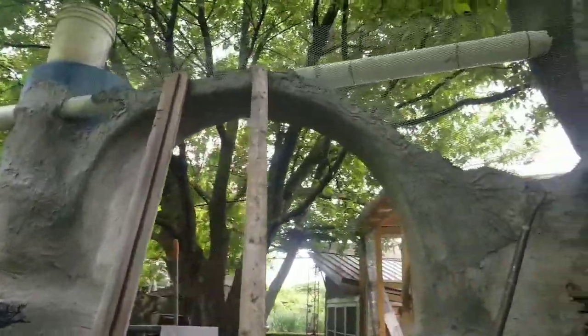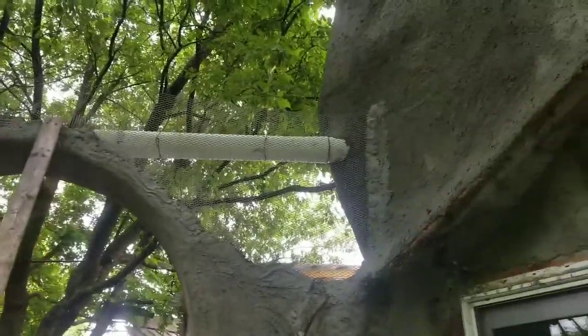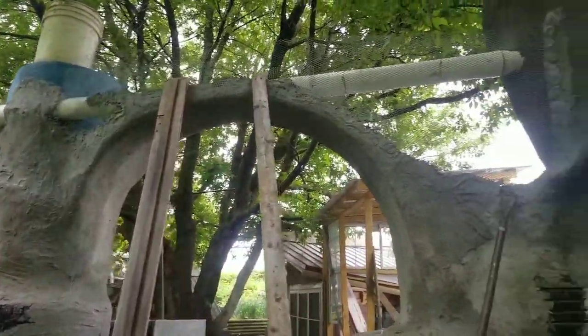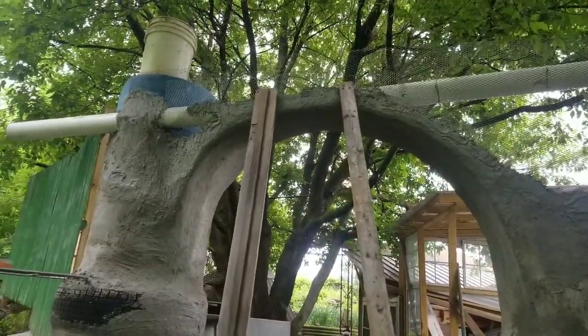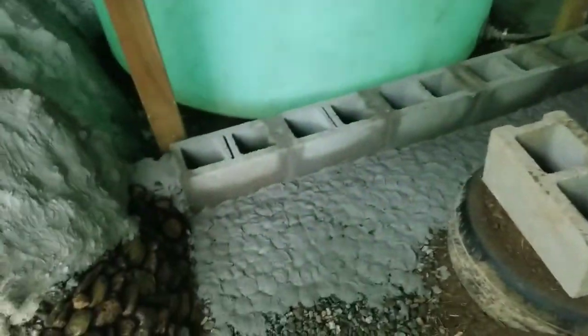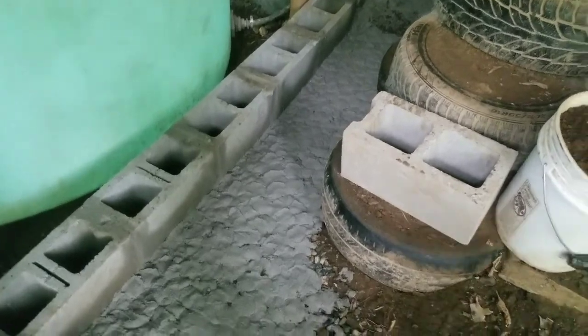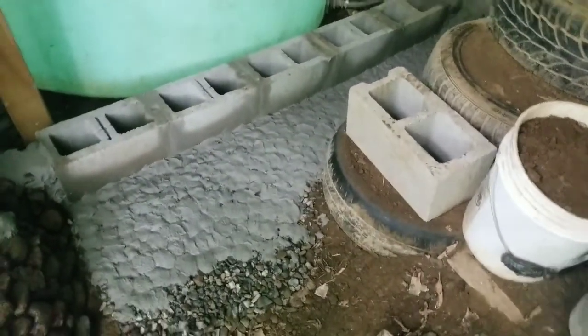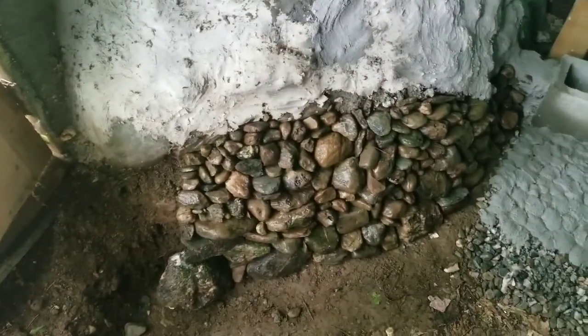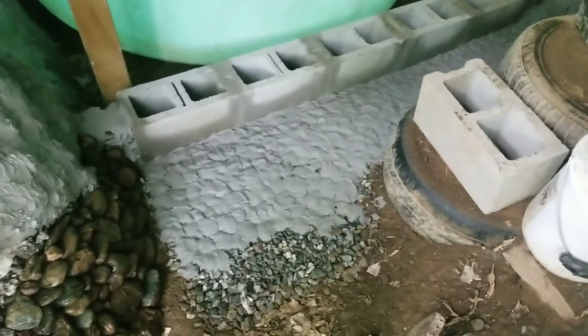It's Thursday. Lath has been added and a line from here to there - that lath has just been anchored with the first coat, so the wood is just holding it, leaning against it to keep it touching the other one as the mortar anchors it before more can be done. In here, got started on the floor to mortar it - there's just some gravel under there and the first coat is just throwing mortar at the gravel so it gets in all the cracks after compacting. This is another rock section reinforcing this whole wall, so once the rocks are mortared and the ground is mortared, that'll be more reinforcement.